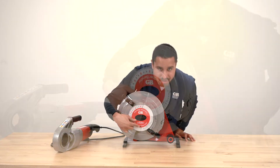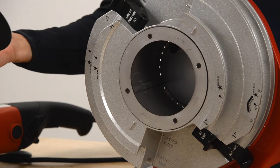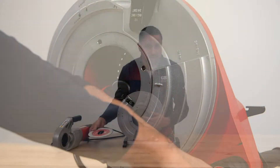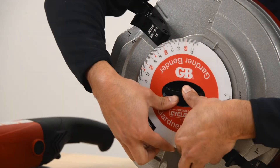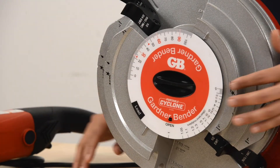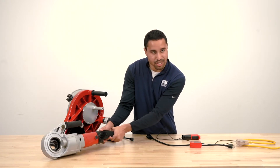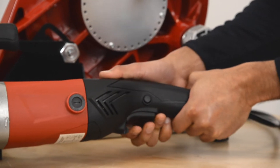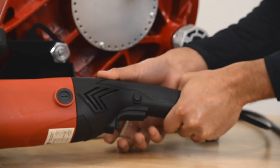You'll see a tab that says 'open' underneath it — just flip up that tab and the dial slides right off. You can store the 12R adapter or your pendant and speed control right inside the bender itself. To put it back on, just slide it on, give it a little flex, and it'll slide right back up — make sure the tab is locked in place. When operating the threader, press the trigger on the threader itself to rotate it and release it to stop. There's also a direction switch underneath the trigger to change the direction of the threader.